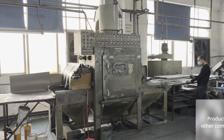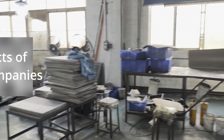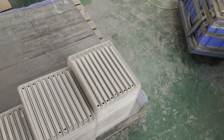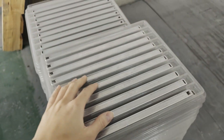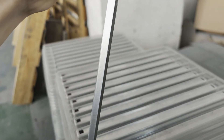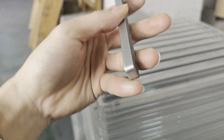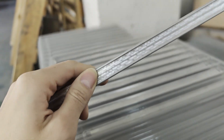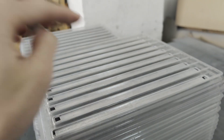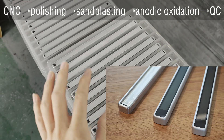I've been at the factory today — this is the sand blasting machine all of our units went through. All of these go through here, with manual sanding as well. Here are 1000 units, with more coming later. As you can see, they're polished. This is the first step of the treatment: it sands off any sharp edges and defects on the surface, and then it goes through oxidization to give you the color and nice-looking, nice-touching texture.